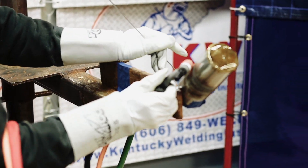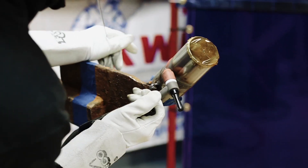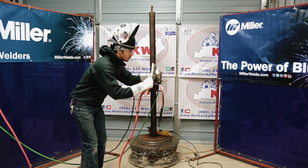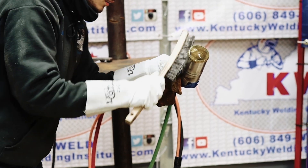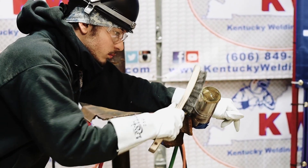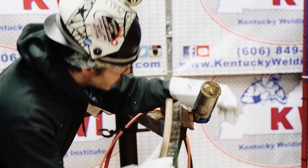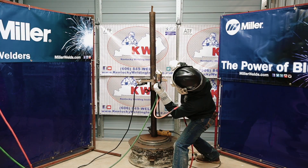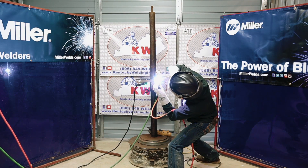After you finish the cap, go ahead and wire brush it as clean as you possibly can. Go ahead and show your instructor, and then if it passes, go ahead and mark it out into four straps, cutting the whole pipe apart. Two of them will be a root bend and the other two will be a cap bend. You will grind both sides completely flush with a flapper disc, making sure you round off the edges, and then you will bend them.